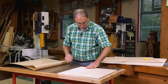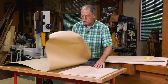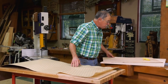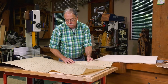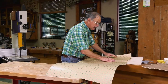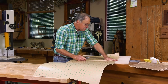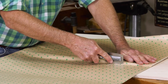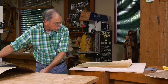Now I can press that piece down. I like the way that's positioned — I had some indexing marks to help with that. Now I can bring this back up and bring it over to my cutting piece. This is a piece of Baltic birch. I'll slide this over and use a veneer saw — a very delicate edge saw — to press up against the edge of that plywood. Watch what happens: you make scoring cuts, and it helps if you angle it up ever so slightly. There we go — now that's one cut.